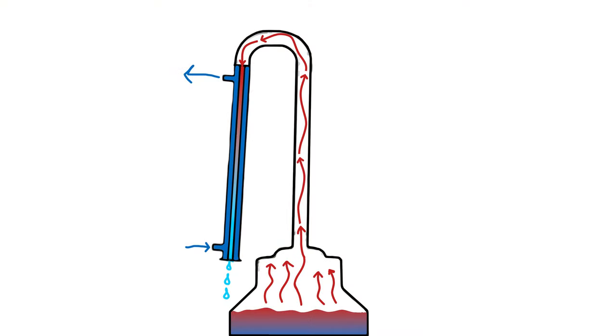These are called Liebig condensers. As liquid in the still boiler is heated it turns into vapor and travels up through the cone and the column, and the vapor pressure then pushes it down through the condenser. The condenser is just a jacket filled with cool water that surrounds the drip arm of the still. Cool water is piped into the bottom of the condenser and flows up and out the top of it. This causes the inside wall of the drip arm to become cool enough for vapor to condense on it and drip out of the still. The cooling water and vapor are in separate chambers and they never mix.